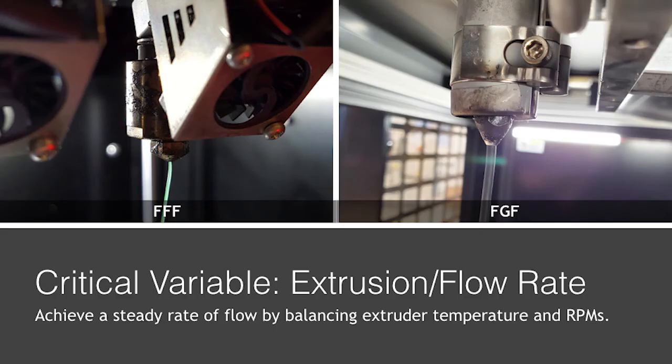Next, we're going to talk about flow rate — the flow of the material through the extruder. After you've selected your nozzle diameter, you know what your bead width is and what your layer height is. You want to establish the flow rate because it's going to ensure accurate part dimensions. The trick is to achieve a steady, consistent rate of material flow where the material is at a temperature that melts and bonds well to the previous layers, but is also rigid enough to hold itself up throughout the duration of the print. The RPMs — the speed of the screw or rollers — need to be matched with the speed of the gantry so that you can achieve the desired bead width that you planned.